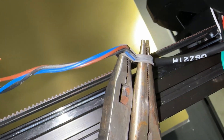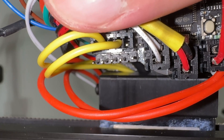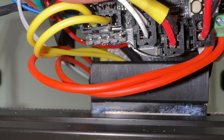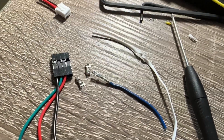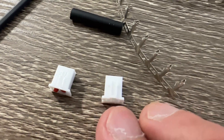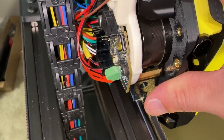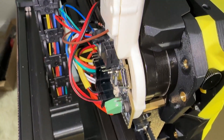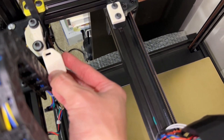I'm going to leave the brown wire long since I need to tap into that 24 volt source. For the diode, the black ring must face toward the probe — solder it on. These header pins are not JST; they used a Dupont or something else, which is really inconvenient. I don't have a Dupont connector kit, so I use the 2-hole JST connector and flush cut the top locking tab for better clearance. Leaving slack is usually a good thing, but works against you when wiring behind the EBB36 due to clearance and rubbing against the Z chain. On the stock setup, the X chain contains all these wires.